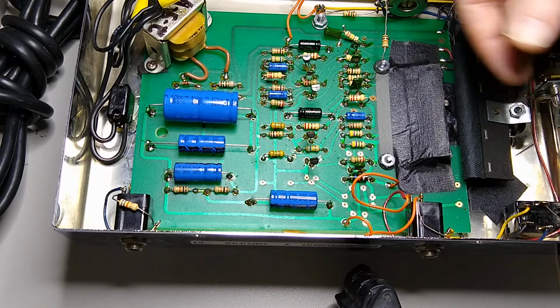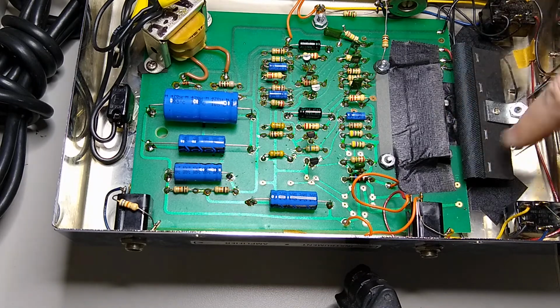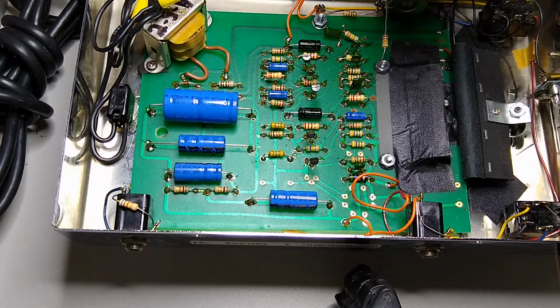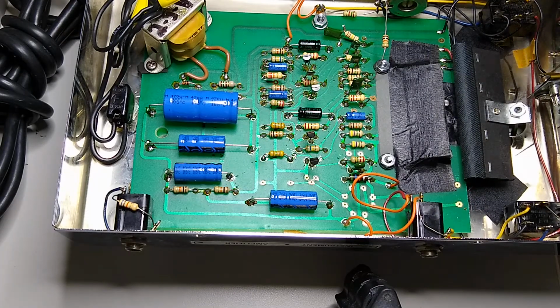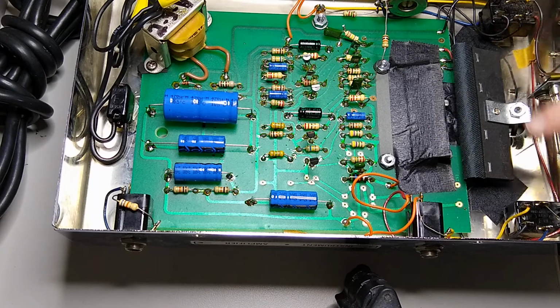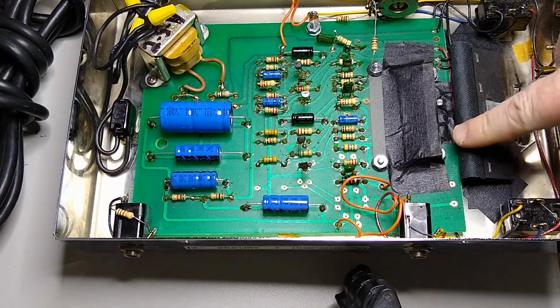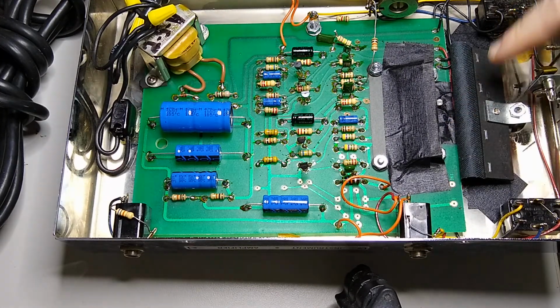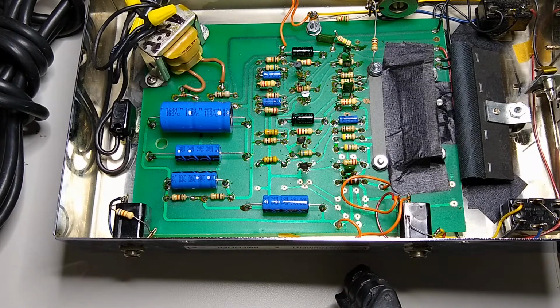Make sure that you don't screw around with the angle of it. It needs to remain flat, and that goes for this one too, which is facing this way. And very, very tiny adjustments, especially on the wah one, will affect the sweep of the wah. You want to make it so that when it's in the full toe forward position, the wah is opened all the way up to the brightest.